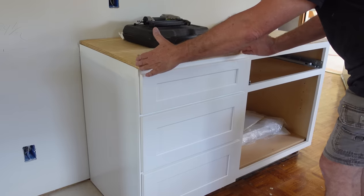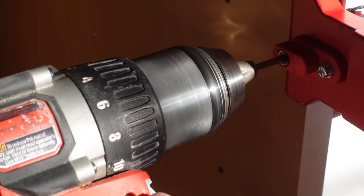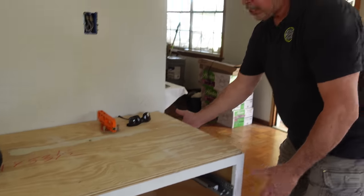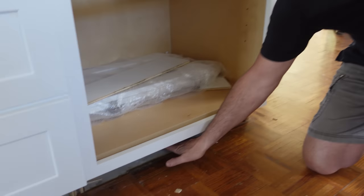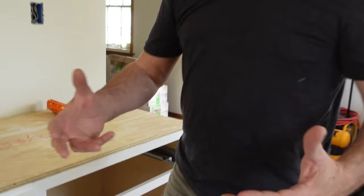So we set this cabinet, again, a shim on each of the 4 corners. Got this cabinet, you saw us attach the face frames together, right? Then we were able to put shims on this side, and because we don't have toe kicks, we could actually reach underneath and put shims in the bottom. Now this is a pretty simple kitchen, right? That Jordan and I are remodeling.